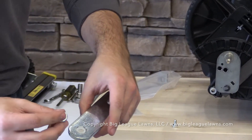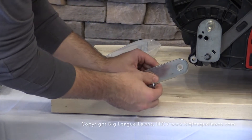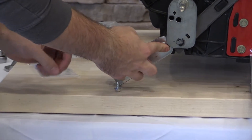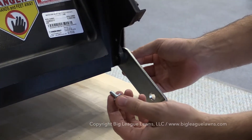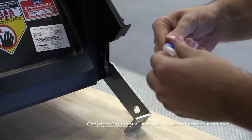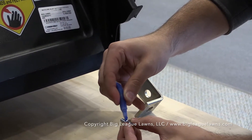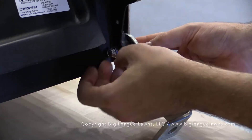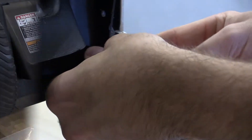Note that on the inside of the bracket, when you remove the connector nut, there's a nylon bushing pre-installed that will sit in there just fine. Line the bracket up with the other nylon bushings in the hole, then place the connector nut through and make sure it goes through to the other side. Before installing the bolt on the other side, apply blue Loctite from your hardware kit — just one drop on the threads is enough. Then thread the bolt into the other side of the coupler nut and hand-tighten until snug, securing the bracket to the PVC back of the frame.